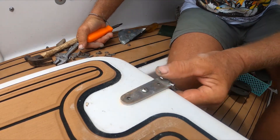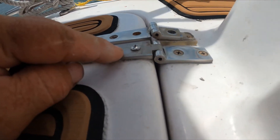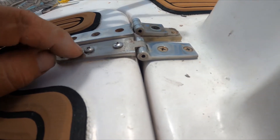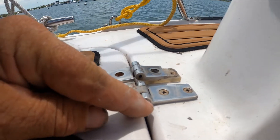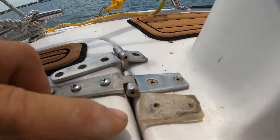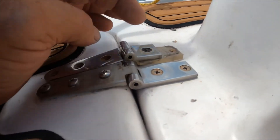Here's what I did: I took the hinge off the hatch lid, took out the roll pin in the center, and flipped over this part of the hinge. You can see it's recessed for the screws, and I put in bolts, nuts, and washers on the other side. The panheads sticking up is fine since this is outside my cockpit. By flipping the hinge over, I've actually lowered the pivot point of the hinge, which allowed me to eliminate the spacer underneath. That spacer was there because before it was too high and they had to put a spacer in to get the hinge to work right — so I've eliminated that spacer by doing this.